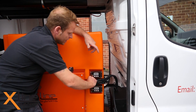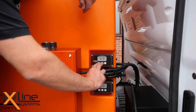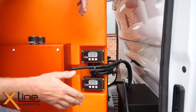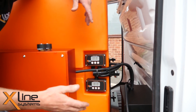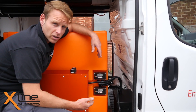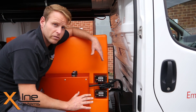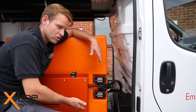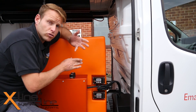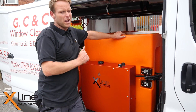Going back to the automated flush and fill system — it's as simple as this. You walk up, connect the hose to the back of the van, press these two buttons here, and it says 'fill'. It starts flushing the filtration system for 15 minutes, maintaining the filters. After 15 minutes it starts filling the tank. Every hour it performs a two minute flush cycle on the membrane, sending water to waste, then resumes filling. When the tank reaches the top, an electronic level switch kicks in and shuts off both product and waste — that's it.